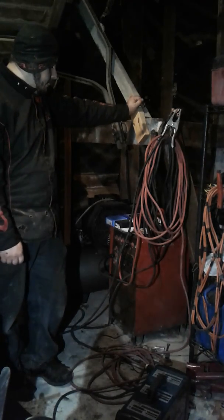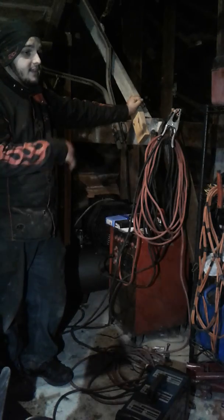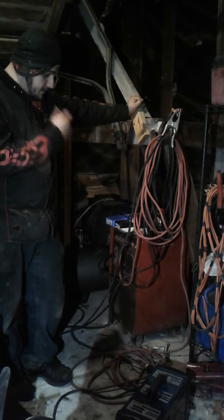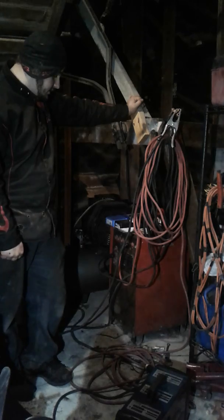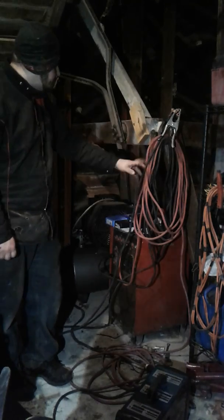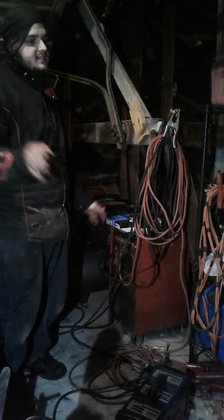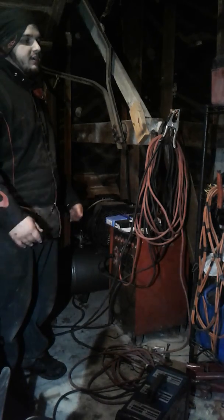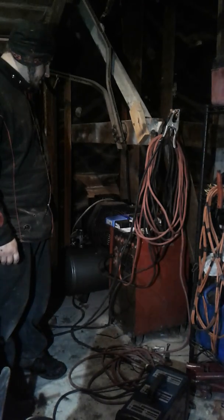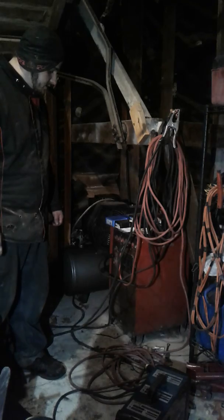On restarts you might want to long arc it for a second to get the puddle going and everything melted, then continue on — that's just fundamentals. The transformer machine has a giant hunk of copper in it, actually three transformers inside. I've run it real hard, checked the leads and the core, and never had a problem. I've heard of people abusing these buzz boxes and never having issues with duty cycle, catching fire, smoking, or getting warm. So that's kind of what you're going to get into with the two different kinds of stick welders out there.